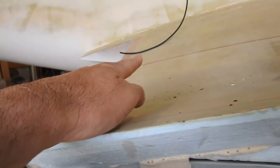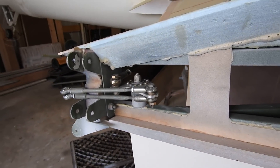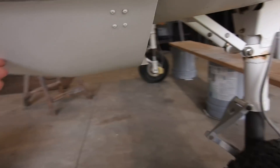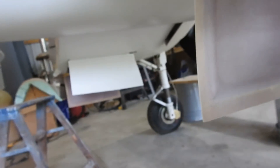There's this one, and then another one that runs up inside — they come down. So all those are put in, and these go out through the back to the two separate flaps. Then the rest of the systems was these push rods here that control the doors. The only thing left is the actuator pin. There's a block right there — a pin will go in there and it'll push up on the linkage, ending up pushing these doors closed from inside. Got both of those done.